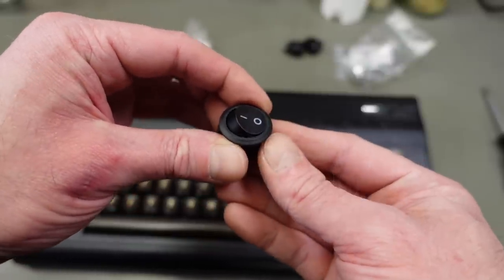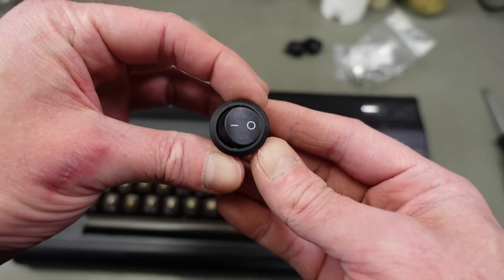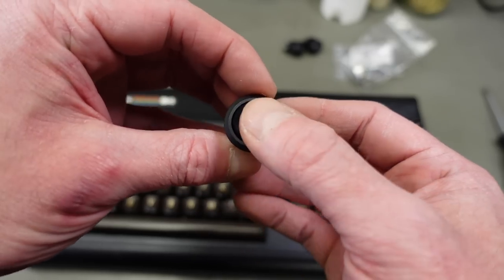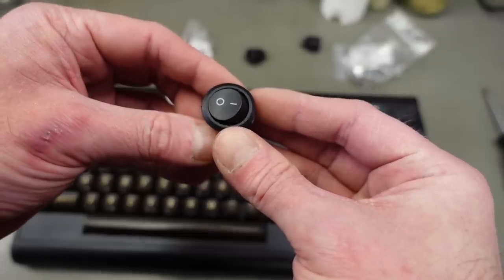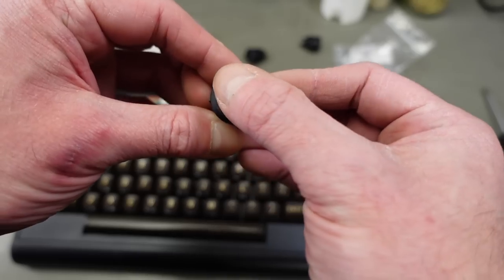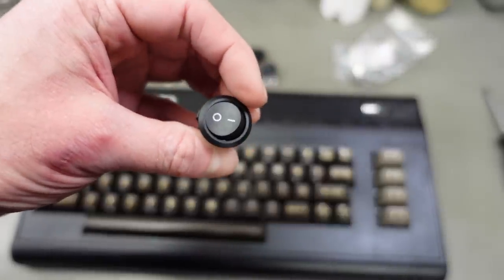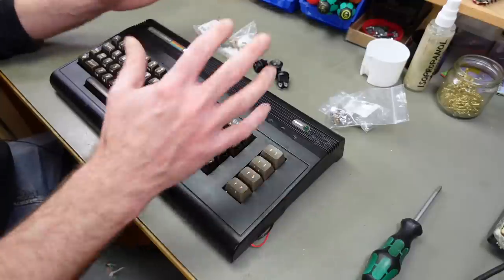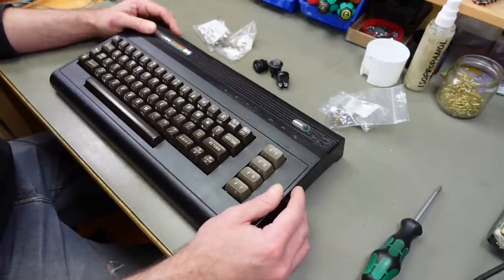One to switch on the internal synth card. So we are going to switch the EVO board into cartridge mode, which is actually a feature that it has. We can put the cartridge ROM into the EPROM and switch to that with one switch. We want the second switch to be the switch for the SID mode, like dual mono or stereo for different use cases. And we want the third switch to be able to switch between the addresses for the secondary SID to be able to use the MSSIAH cartridge. So yeah, the plan is to have this easily switchable to different modes of operation, basically, that I need.